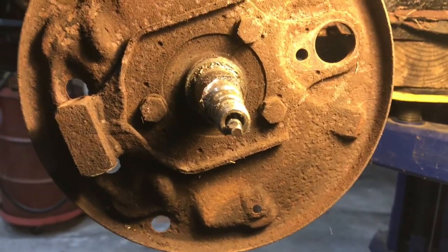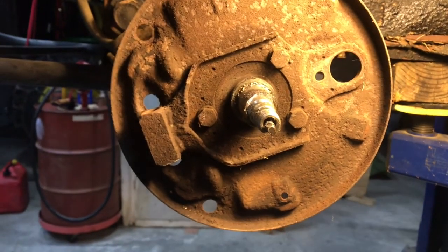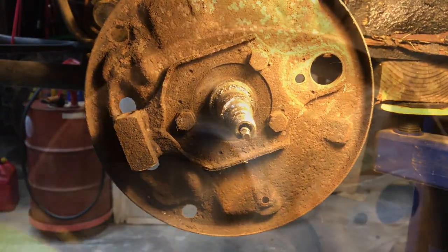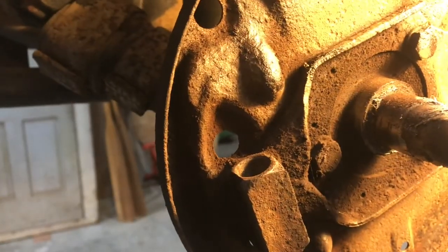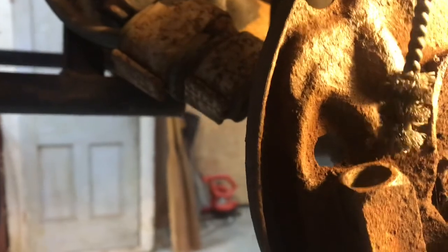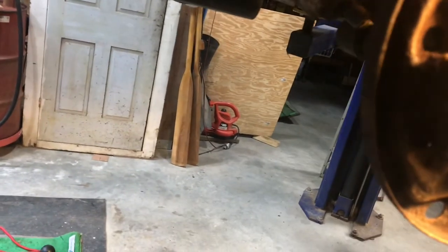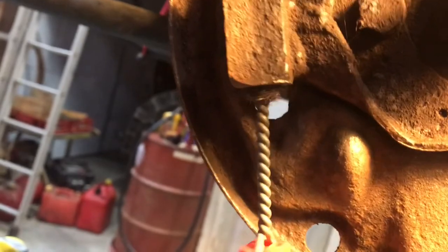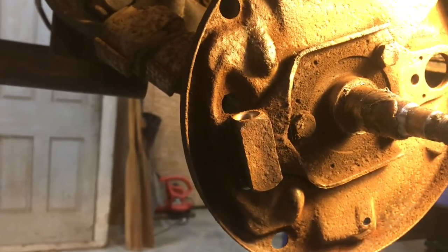It's basically impossible to do one-handed while holding the camera — I really need to get a stand. So I'm going to put the camera down and do it with two hands and then come back. And there, it's done. Next thing I want to tackle is the adjuster bores. These all came apart pretty good, but I want to clean them out, make sure they're smooth. I'll use this plumbing brush — the kind you'd use for cleaning three-quarter inch copper pipe — blow it out with the air gun and make sure it's nice and clear.